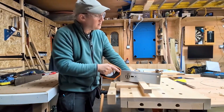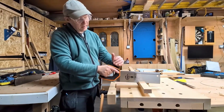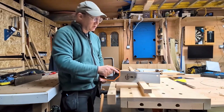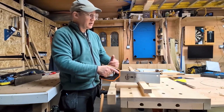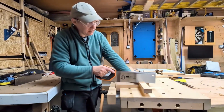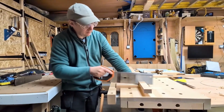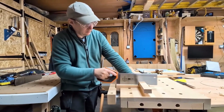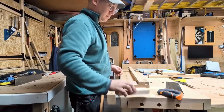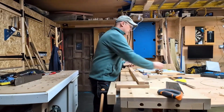If you find that your cutting isn't that straight as you're cutting through, you can use your wrist to put a little pressure on the blade. It will cut through the timber as you're cutting. You don't just stop it and twist the blade hard. You've got to put a slight pressure on it as you're moving back and forth, and you can correct your cuts. When you're doing longer cuts, it's easier to do that. But we'll do those in a longer lesson with rip cuts through the grain.